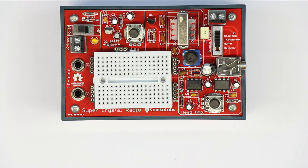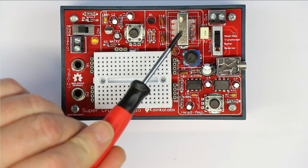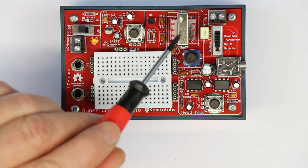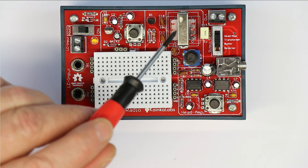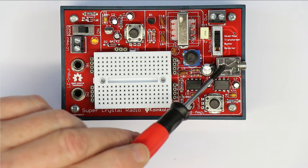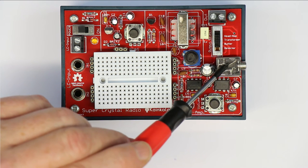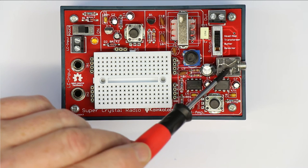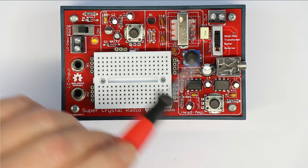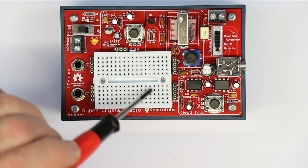We sell the crystal radio set in two versions. Here we have a transformer with an impedance ratio of 50 to 1, which means, for example, a 100 kilo ohms output impedance of your crystal radio is transformed 50 times down to 2 kilo ohms, and that's the right impedance for 600 ohm headphones. Just to mention, if you use stereo headphones, then the left and the right channel are put in series, so you get double the impedance of your headphone. If you have 600 ohm headphones, you use effectively 1.2 kilo ohms because they are put in series, and this 1.2 kilo ohm times 50 is transformed to 60 kilo ohms here as a load to your crystal radio.